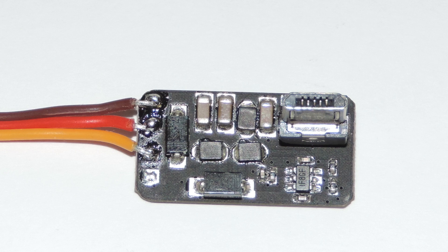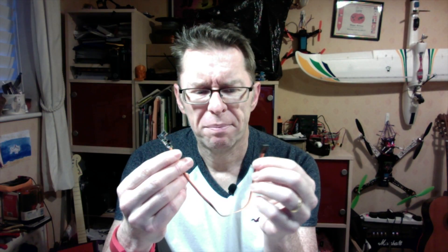So that's fixed and I can fly it now — hooray! I've also got the GoPro one, so if I want to swap back I just plug that in and I'm good to go. That said, this easy alternative — which I'm guessing is basically just a 5-volt regulator — is built for an RC-type connector, and I can't think of any RC setup like a quad or plane where you won't already have some sort of 5-volt BEC on it.